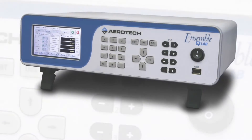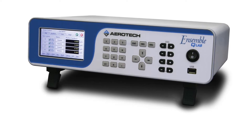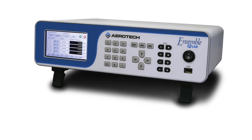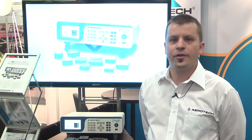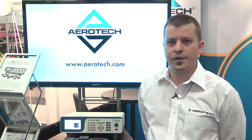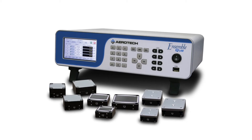The QMP Series is controlled by Aerotech's Ensemble QLab controller, built upon an existing and powerful controller network. The QLab is an easy-to-use and modern interface, including advanced features such as Iterative Learning Control and Harmonic Cancellation. The controller also takes advantage of feed-forward techniques and additional integrators in the PID loop to minimize position error throughout the travel of your motion profile.